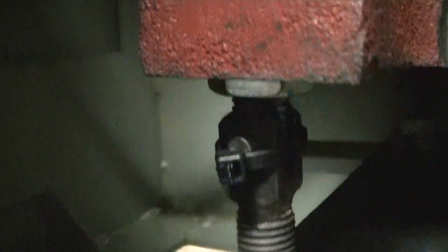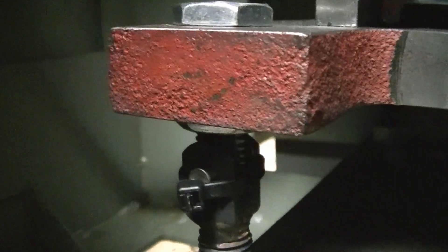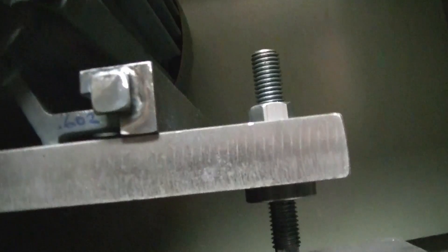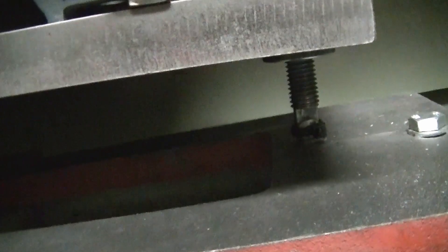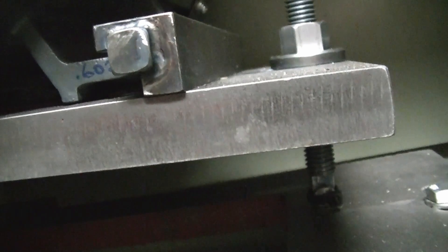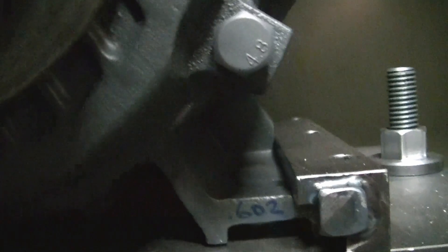What I've done here is made the plate pivot by modifying the studs back here with a pivot — that's a wire tie just holding the pivot pin in place, and both those back legs have those. Then here in the front I've made a captive nut that is tight on both sides of the plate and also has a pivot, such that I can rapidly tilt this thing fore and aft.